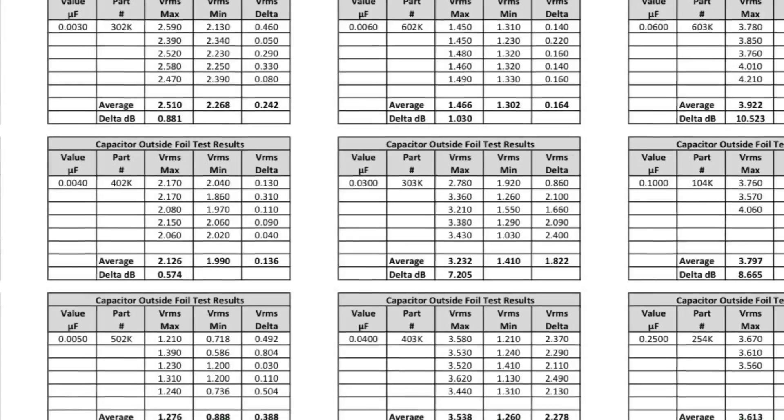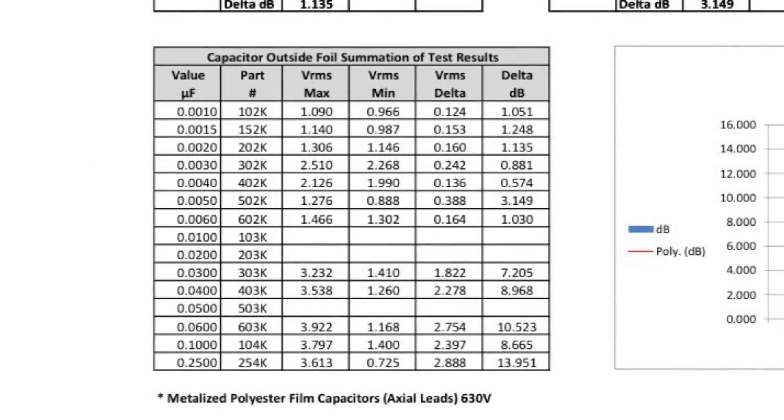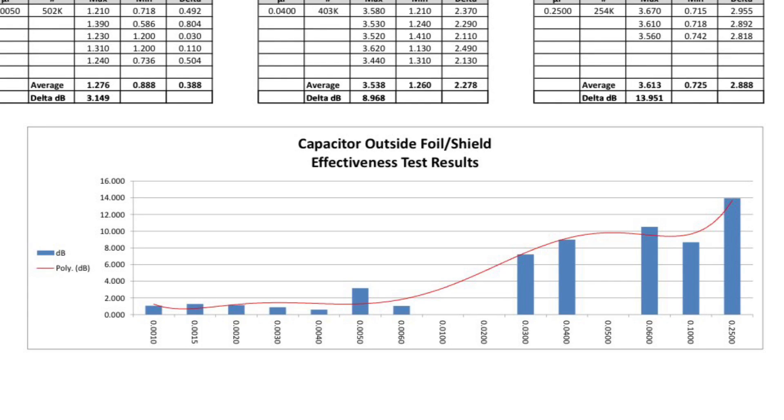What I was doing was looking at the signal strength on the oscilloscope at the outside foil and reversing the leads of the signal generator to understand which location creates the highest amount of signal on the shield, which ties back to the outside foil location. As you can see in the chart, the lower value capacitors are hard to discern when measuring and have very little difference when looking at voltages converted to decibels. Below 0.01 microfarad the differences are minimal, but as the capacitor values increase it definitely provides an opportunity to ensure the outside foil is correct, because those numbers really jump up.